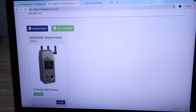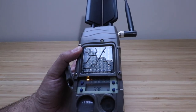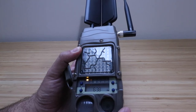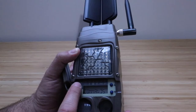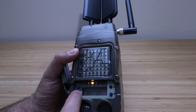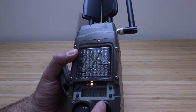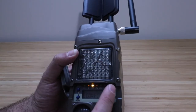Let's test this out and see if we get something on our cell phone. Now that the cell phone service is activated online, we need to have the camera register that service. Go into 'Mode,' navigate to 'Commands,' then scroll through to 'Cell Menu.' Press 'Up' twice to confirm. Now click 'More' twice to navigate to 'Cell Test,' then press 'Up' twice.